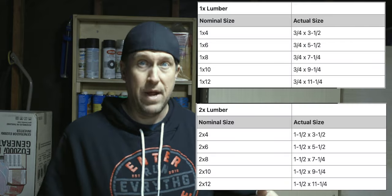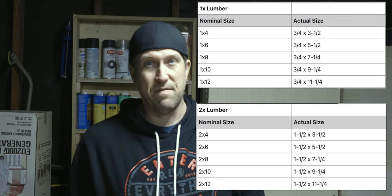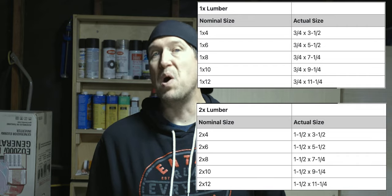That's what we're gonna do, and we're gonna do it using a saw, hammer, measuring device — just a tape measure — pencil or pen, and then you need a straight edge of some sort. I'm gonna be using a speed square because that's what I got, but anything with a flat edge that you can draw a line across will work just fine. Other than that, you'll need nails — inch and a quarter or one inch nails will work fine — and one board of one by eight. Remember when you're getting wood: even though it's a one by eight, it's actually three quarters of an inch by seven and a quarter inches, so it's not an actual one inch by eight inch board. When you're buying lumber you just need to be cognizant that one by or two by wood isn't the actual dimensions. So with that we have everything we need.